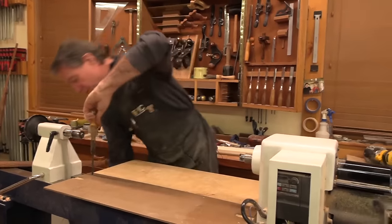But more than that, it's indexed so that this top pinhole, if you just use that one and then rotate until you fall into the next one, the top one is set up so that you have 12 indexing holes to go around the 360 degrees. So you end up with 12 flutes for that one. I forget what the second and third one are.